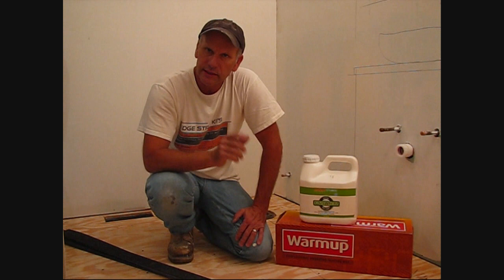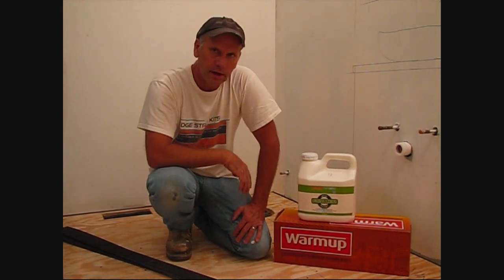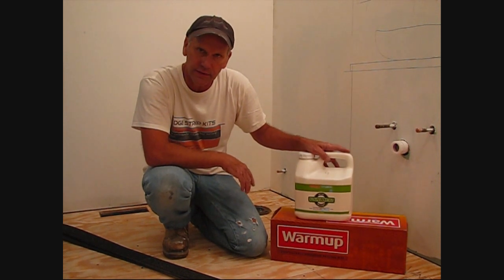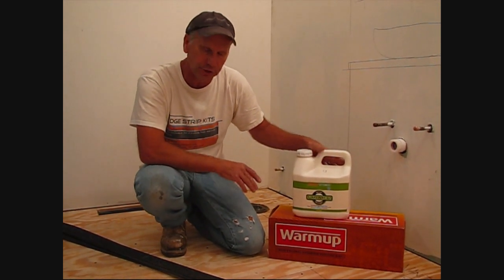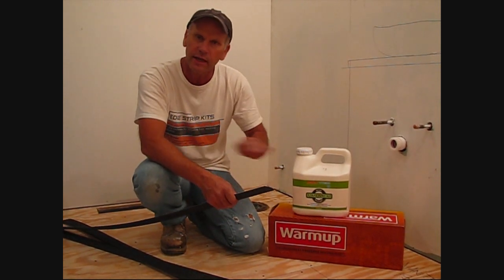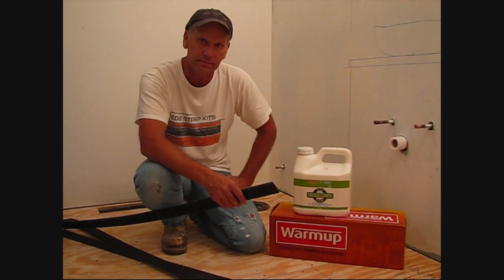My name is Phil. Today we got the opportunity to be installing a Warmup floor heating mat. We're going to actually be using DryTech self-leveling compound that's distributed by Laticrete, and we'll be using our edge strip kits to make sure that we encapsulate the wire and create a flat surface for our tile.